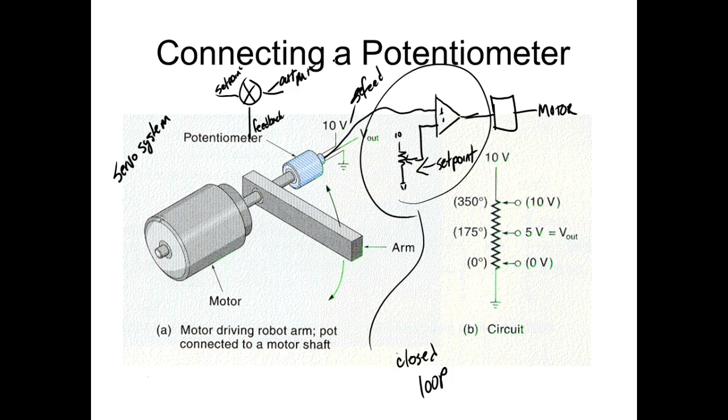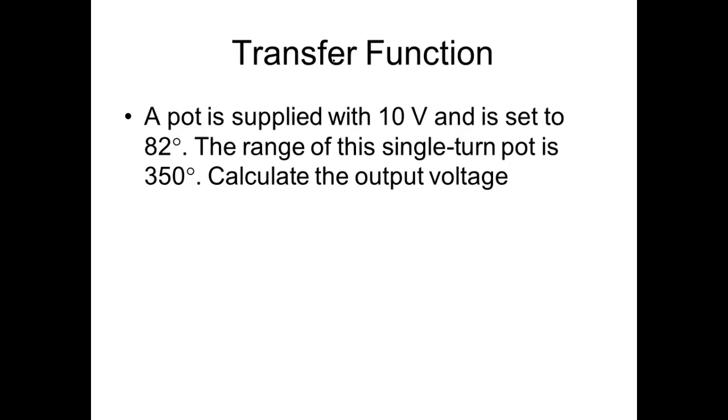We're setting the transfer function. We're saying 10 volts equals this. And that gives our PLCs an accurate measure of what it is. So a scaling instruction on a PLC would be one that we'd use to actually set the transfer function.